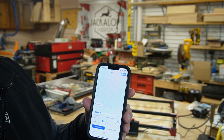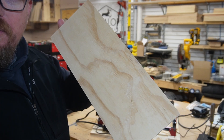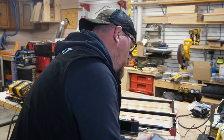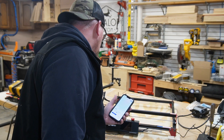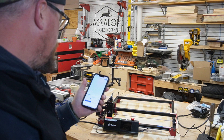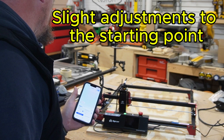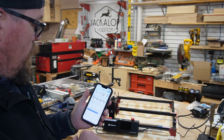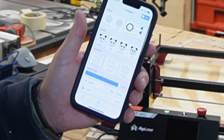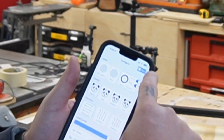When I'm ready to start, I hit the start button and we find something to engrave on really quick — here's a scrap piece of half-inch plywood. I frame it one more time just to make sure I'm good to go. Highest quality setting, contour and fill, going horizontal back and forth, 100% laser power, 8,000 millimeters a minute. We're going to do it one time and let's see what happens. Fire away.